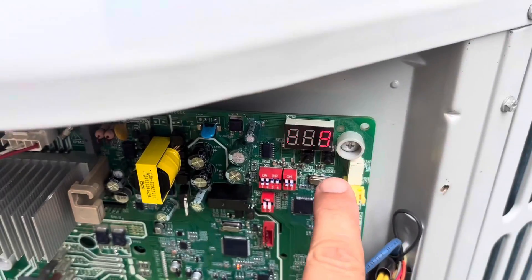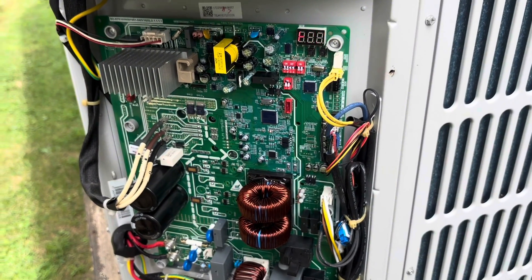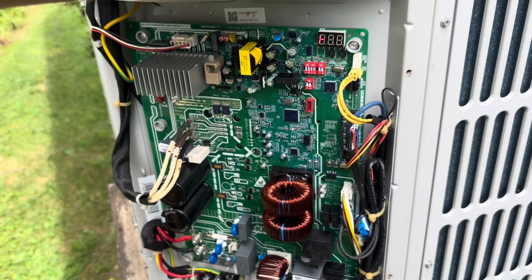By pressing this force button it sends it into high speed as long as we have a call, so we'll let it run like that for a while. The reason we finally got to replacing this board was a whole bunch of issues we could not explain — tech support couldn't explain it either. Finally one technician found it was reading a P error, which is a compression ratio protection fault. Tech support eventually just said to replace the board, so that's what we did. This video was shot about a week ago and we haven't had any issues since — let's hope it stays that way. Don't forget to like and subscribe, check out Jobber — link in the description.